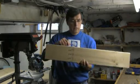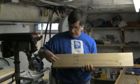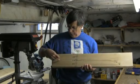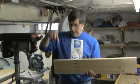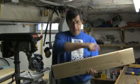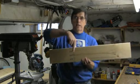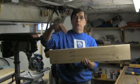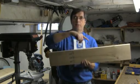This is a two-by-six and we're going to drill some big holes in here — an inch and a half diameter, one in the center, and three inches from each end will be another one on both sides. Then holes drill down vertically all the way through, and our gas pipes will run across the top and across the bottom. This will set us up for the z-axis, which will be coming up in the next segment, and that'll run on these pipes here.